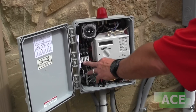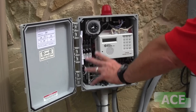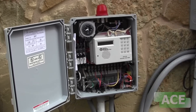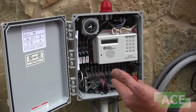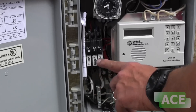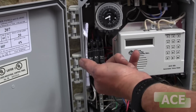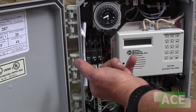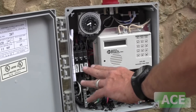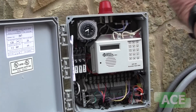These are your breakers that may trip — they're within the system. If you have to reset the system, I say spell CAP: compressor, alarm, and pump. You would turn them all off — spell CAP, that'd be C-A-P. If the light is on and you have to reset it, you do that right there and reset the system by spelling CAP and the light goes off.